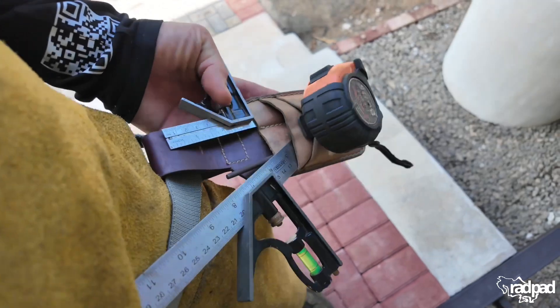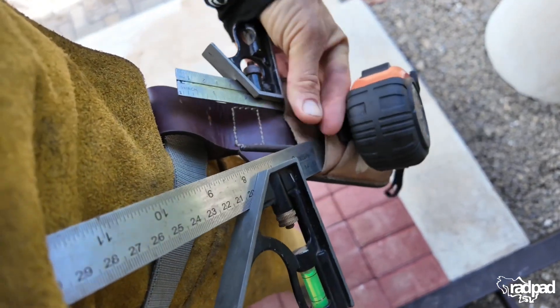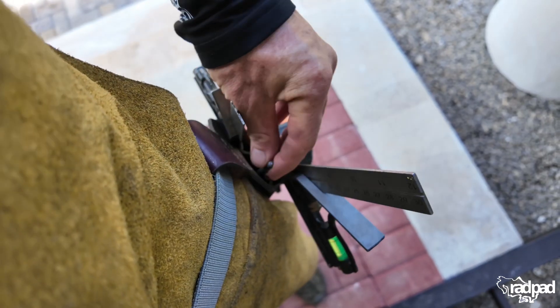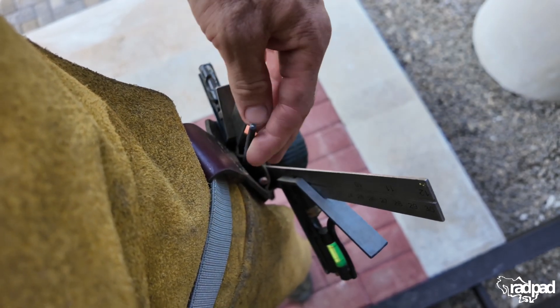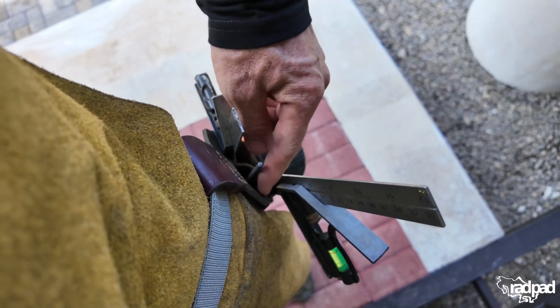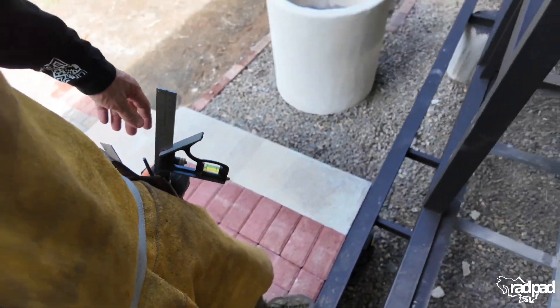You want to do a quick little welding job? I'm going to show you everything that I need to be able to work efficiently. I've tried doing it with less but I need it all — every single part. I've just finished getting set up to weld the beds in the bedroom and I'll show you the supply list. It starts with this, my little pack. I've got two squares — one is used for marking and one for checking the square of the piece I'm welding. A marking pen or a steel file used to scratch the line in it. A pencil for writing down a cut list of the pieces I need to go and cut. My little knife and measuring tape. That's it for what's on me.